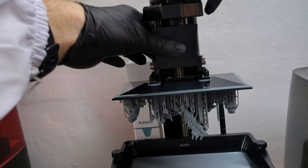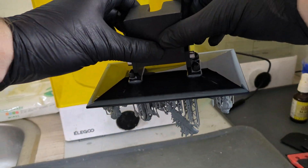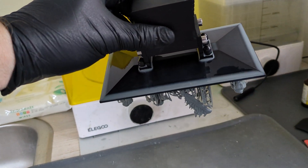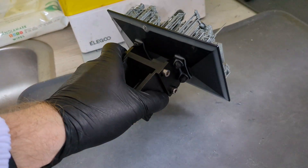Before I do anything else, I make sure that my cleaning space is ready and the tools are ready — this means good light and no clutter. Then I open up the printer, detach the build plate, and carry it without changing the angle over to my cleaning station, to avoid spilling resin when I move it. I lay the build plate down on the side onto my cleaning mat. If there is a chance of sunlight hitting my printer, I go back and quickly put the UV cover on.